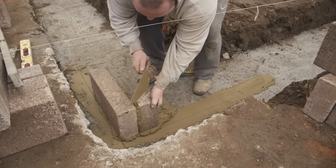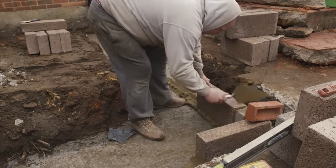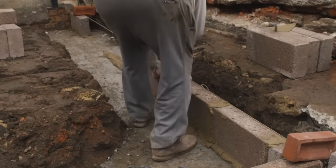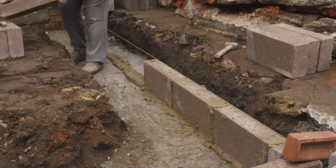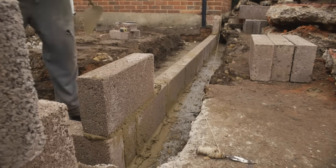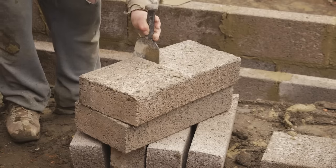It's structurally important to stagger joints — if a joint runs all the way down, that creates a weakness under heavy load. So you always stagger, hence it's called brick bond. You go: full block, full block, then offset the next course so it sits roughly halfway along — this creates a more sturdy base. If you need to cut bricks or blocks, the old-school method is a hammer and bolster, but these days a petrol grinder gives you an exact, clean cut rather than risking a shear or crack. You can hire one if you don't own one.